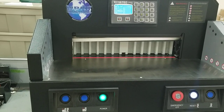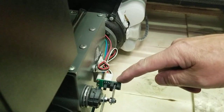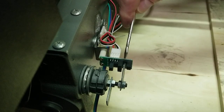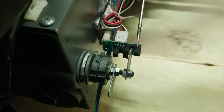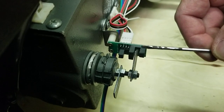You'll need to take this table off to check your blade positioning sensor — that's this right here. These are your metal tabs that go between these sensors. You want to make sure you check this: the tab goes right between the middle of the sensor, right in the middle of it, and it needs to go at least halfway in.